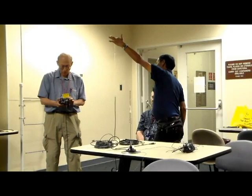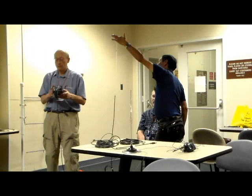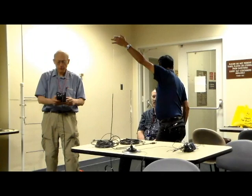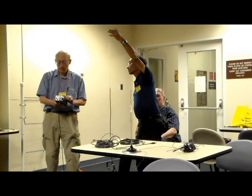So this device is an MFJ. It's the best thing I ever bought. It wasn't cheap, because this is dual band. It goes from 4 megahertz all the way up to UHF, meaning 440. Best thing I ever bought. So I'm on 146, and I read greater than 31. So I'm gonna kind of sweep it around, tune this thing, and...